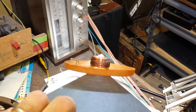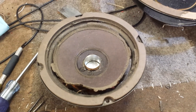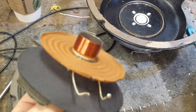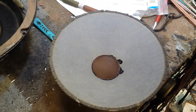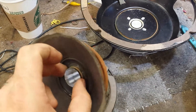It's bubbling, it's turned into a little blob of copper — it's dead. The donor is a woofer from an Advent, Jensen-era Advent six and a half inch. It's got the exact same voice coil diameter. The impedance is 8 ohms, and the DC resistance is pretty damn close. The good woofer measures about 5.2, and this one measures about 5.4. So unless you're a true audiophile, you're really not going to notice the difference.